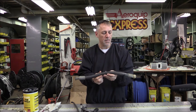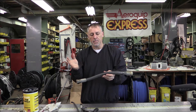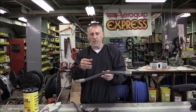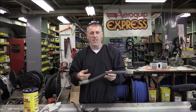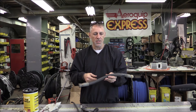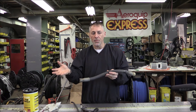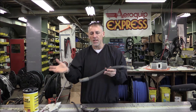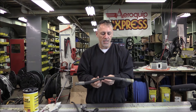If I were to make this up, I have recommended in other course materials - just carry two-wire hose. Just carry GH781 in all sizes. It handles all one-wire applications. You're not carrying dual stock, you're not carrying dual fittings, because in a dash 20 you have to have two different types of fittings.